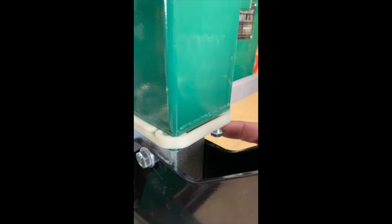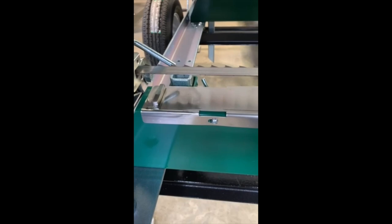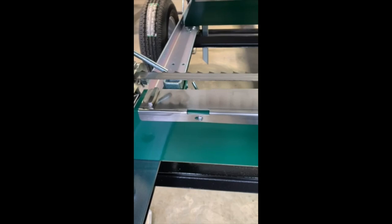And when it's all set, when you got the saw set at 1 inch, then these two should be touching and you shouldn't, in theory, be able to go any lower than that. And it's nice to know that number so when you're sawing, you know you got a 1 inch minimum, you know your log stop's gotta be at least an inch or below an inch high on that last board. So if you keep them lower than an inch, in theory, you can never hit them with the blade.